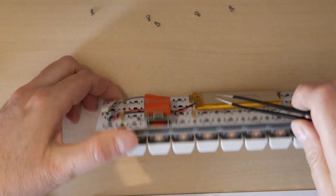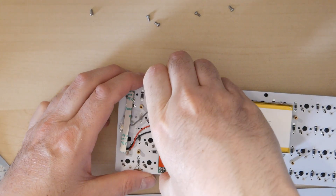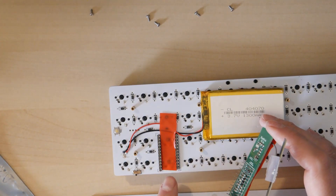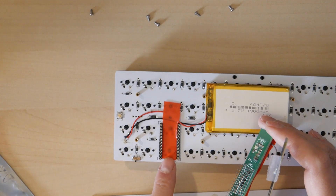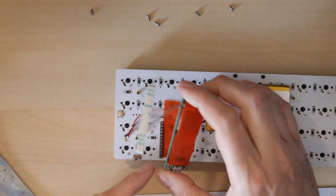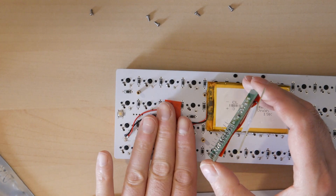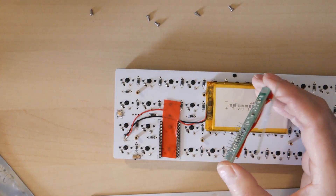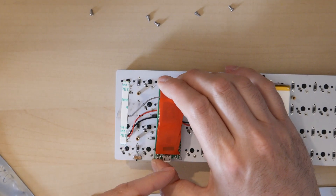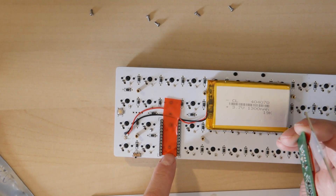Once there's a little more opening you can insert the tweezers and apply some force. I've put tape here to protect against shorting against the pins — it doesn't happen often but it's a good precaution. These are diode legs pushed through holes punched in masking tape, then soldered, trimmed, and the masking tape peeled off. I then apply electrical tape to prevent any shorts.